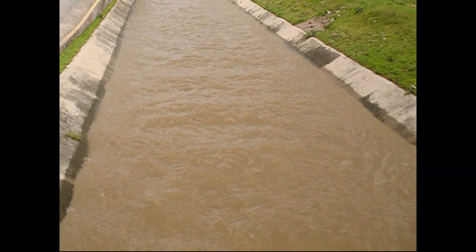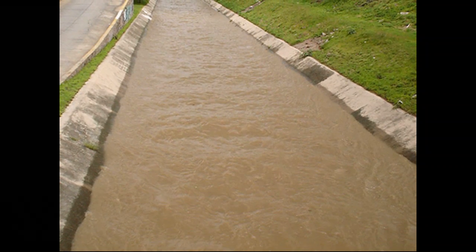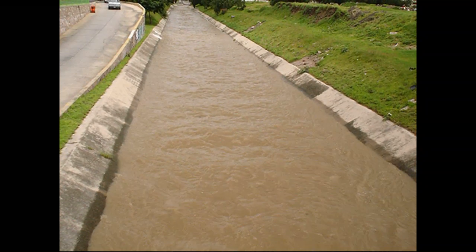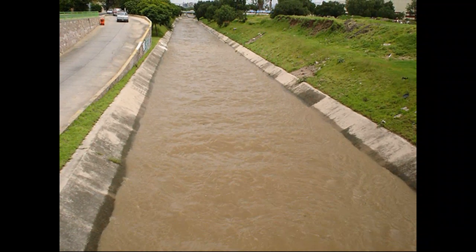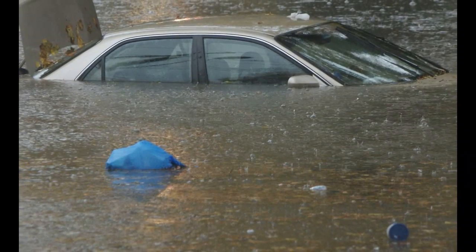Let me try to better explain this with a good analogy, a river of water. The larger the river, the more the water can flow without overflowing the banks. This is the same general effect with wire. The larger the wire, the more current it can carry within its thermal limits. Now imagine there's debris and obstructions in the river, or resistance to water. This will reduce the amount of water that can flow, and if too much water tries to go down the river, the banks will overflow.